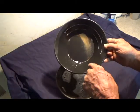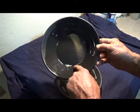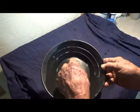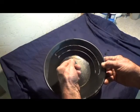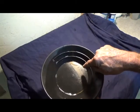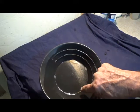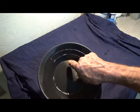That didn't take me long at all. Right down here are the coarser particles — see how they just zipped right to the bottom of the gold pan? Here is smaller, and here are the smallest particles; this goes down to 1 or 2 thousandths of an inch. If the layer was thinner, they'd basically all be up here, but there's so much gold it's tending to slough down a little too. The difference in size between what will stick to the bottom and what will run down is right at around 100 mesh. The 100 mesh and coarser gold runs down the surface, and the 100 mesh minus tends to stick. You can see how it's sticking right there.